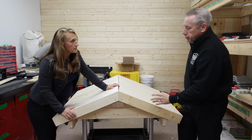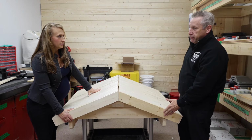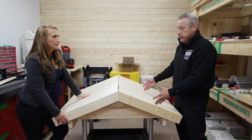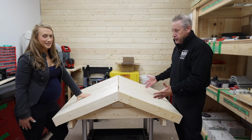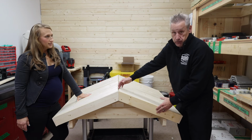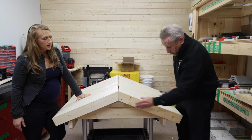When we do the edge work, this is the part people want to overlook. It's an expense they want to save on. I want less of the trim, I want it at the top. The reality is the steel sheet will never leak. It's a steel panel. It's not going anywhere. Where your roof could leak are the edges, which are the seams. So we protect the seam as much as we humanly can. So this is the gable edge, and then there's an eave edge.